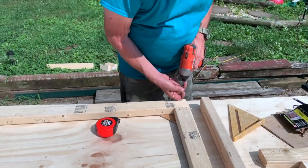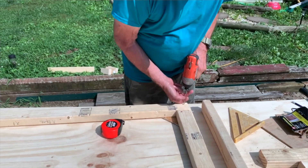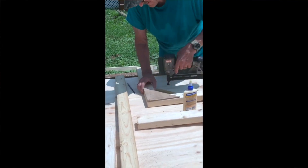What is the skill level to do this? Are there special tools? There are a lot of specialty tools, but generally only a person that works in the trade is going to own those. I had a 12-inch compound miter saw that I used during the construction of my trailer — it was a $600 saw. The average person doesn't have that, but you can go and buy a Ryobi battery-operated miter saw and make miter cuts. You can use a wooden $3 miter box and a hand saw. The difference is the more expensive tools are less effort and they're faster. You can get the same results with rudimentary tools if you're conscientious and careful.